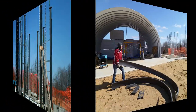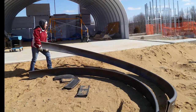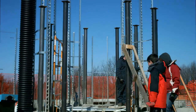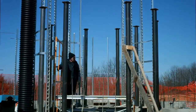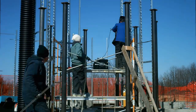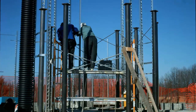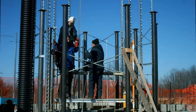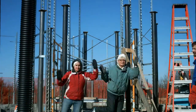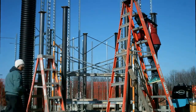So I wanted to weld the big ring beam on right away, but each half was about 320 pounds — we'll need a proper crane to do it properly. In the meantime, we decided to weld some rebar between the posts as a temporary solution. It was nice and easy, and I actually kind of like the look of it, so it'll be sad to have to cut most of it off when we put the door box in. That's it for this portion of the build. Now the quad deck can be added and the concrete floor poured over the basement, which will lock these posts in place nicely.